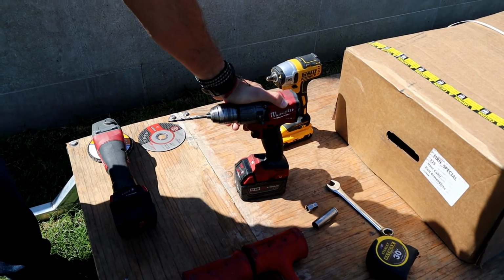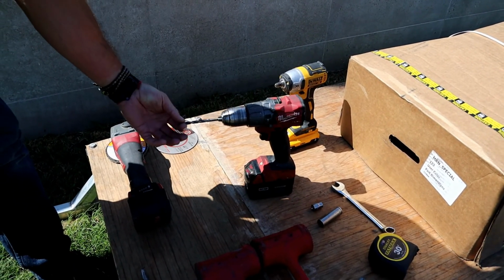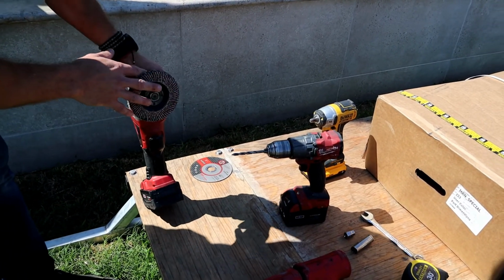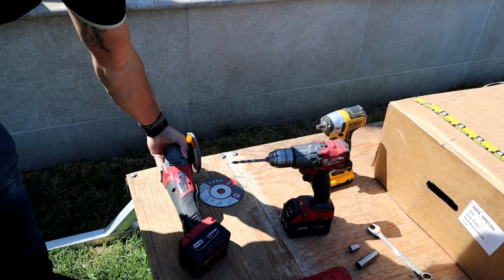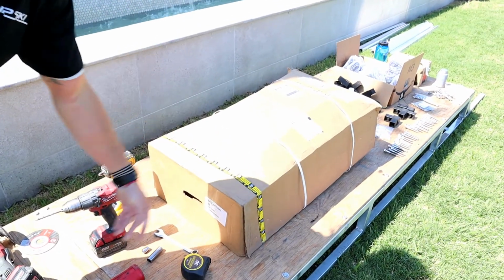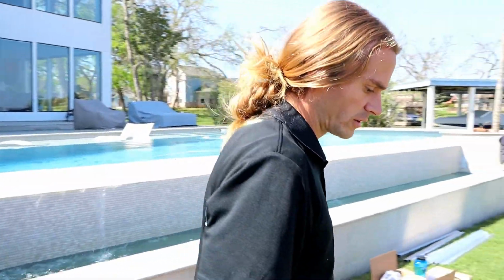We'll need the drill for this build. All you're going to need the drill for is for your lag bolts on the dock with a 1/4-inch bit, and then a grinder. The grinder is going to need a cutting disc for aluminum and then a flapper wheel. That's going to be basically it for your install. One more thing that's going to come with it is the tarp. Whichever color you've ordered, and it's going to be already sized out to your dimensions, of course.